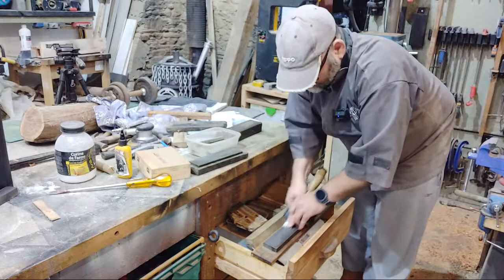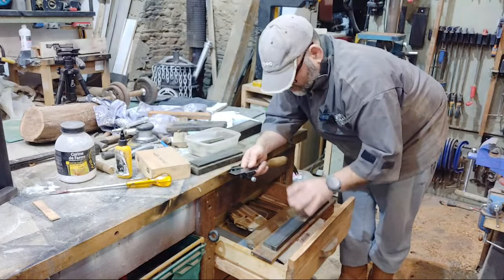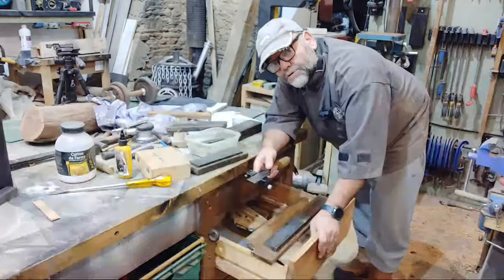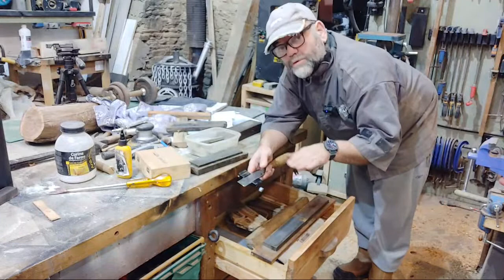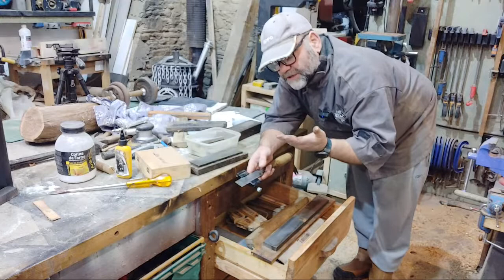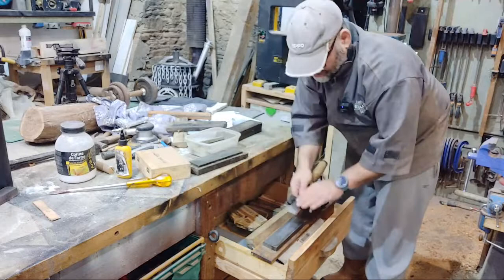So you can use tools like stones like these if you like. This is the coarser, that's the finer one. But otherwise, there's whetstones you can use. I don't recommend a proper whetstone, because they're so soft. Unless you really know what you're doing with them, there's a process where as you sharpen, you have to have another stone which is perfectly flat, so you're constantly flattening off your whetstone as you're using it. So it's a hell of a faff, but can you get a good sharp edge? Oh my God, can't you just? It's amazing, absolutely amazing. But for most people, it's not necessary.